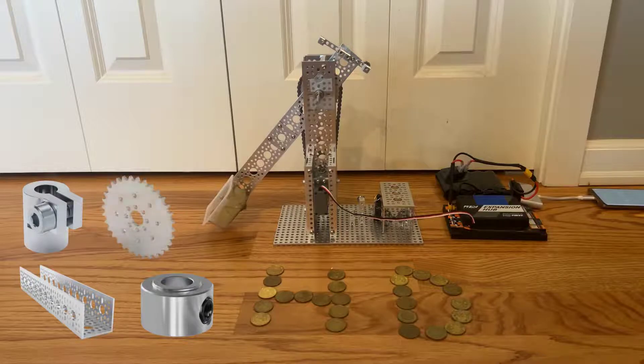We've also got a chain with a 32 tooth sprocket to 16 tooth sprocket, and this doubles the torque of the servo, although it also halves the arm's speed and freedom of motion. But that doesn't matter too much here since the arm isn't moving that much, and you also don't want to move too fast or else you might throw off your accuracy.